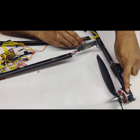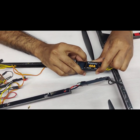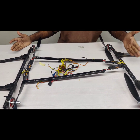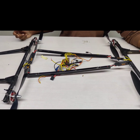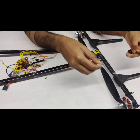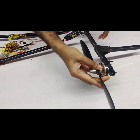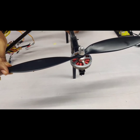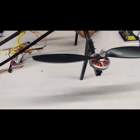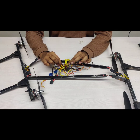For the ESC we took connections from both motors, so we are using four ESCs for four motors — 40 ampere ReadyToSky company ESCs. For the drone body we used aluminum sections made out of e-waste, sourced from dump yards and scrap yards. We also used rubber tire pieces to absorb the vibration of the motors. The propeller here is 12 into 3.8 — 12 is the diameter and 3.8 is the pitch of the propeller.